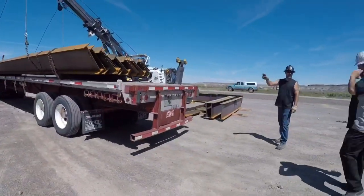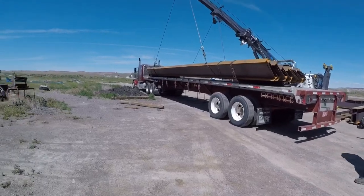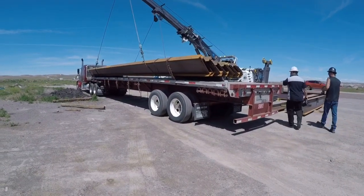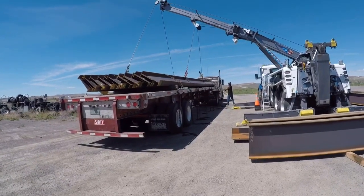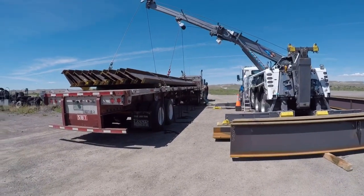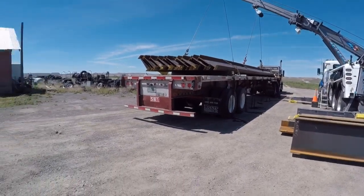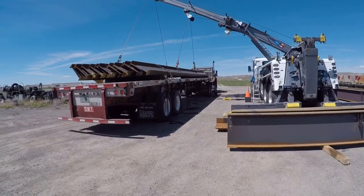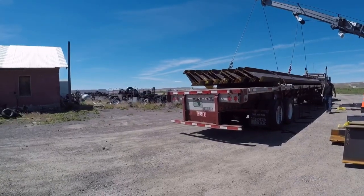All right, what you're gonna see here is I got the two main lines of that boom going out with our Miller frame chains to hook that outside beam that's just hanging out there in the sky. Once we got hooked onto those, we were able to let loose of the chains that were going over. And then you see I got snatch blocks in here on them lower lines. Those were what we were actually using to stand these first 3 pieces of angle iron back up on the trailer so we didn't have to remove it all. So a nice part of having 4 winches on a boom: just slap some snatch blocks in there and stand them up.